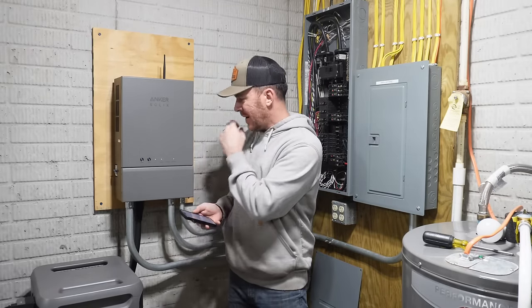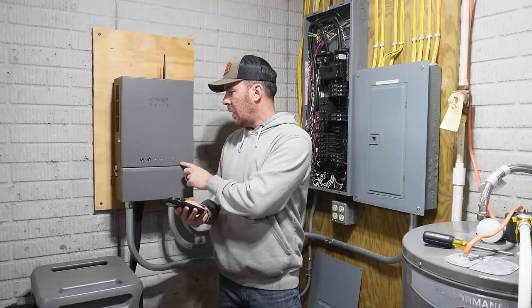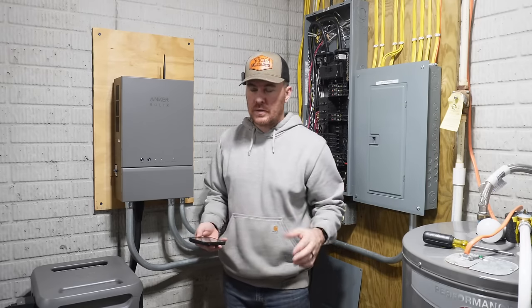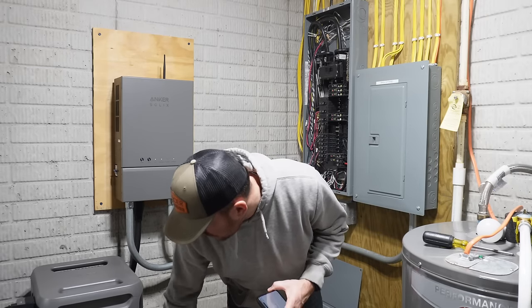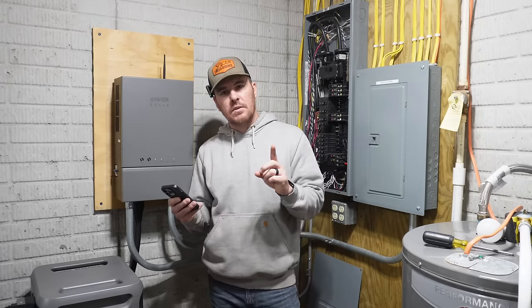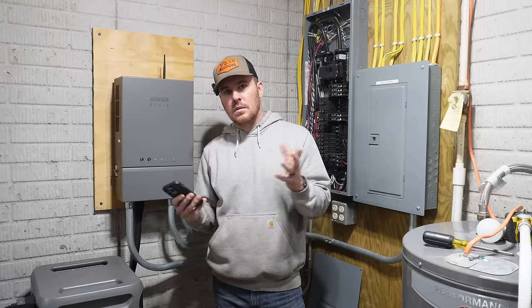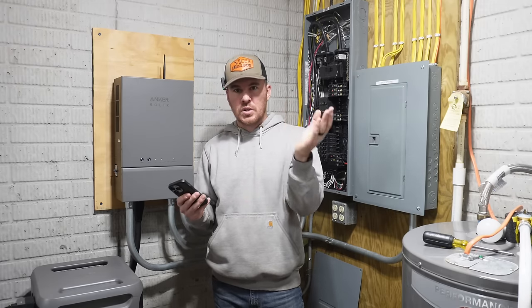So the grid is back on. And then I think once it stabilizes for a little bit, you'll hear a click, and that will actually transfer power from the battery to the grid again, which is pretty normal for an automatic transfer switch. Because right now it's still showing that we're pulling 836 watts, so it hasn't switched over yet. Give it a second. There we go. I saw the lights flicker a little bit, so there is a very quick transfer happening.